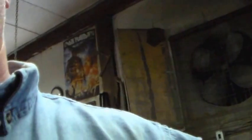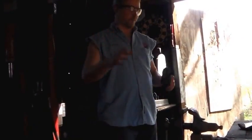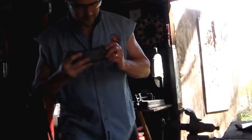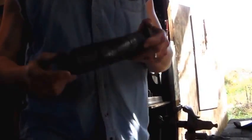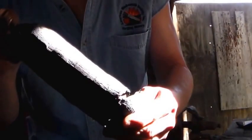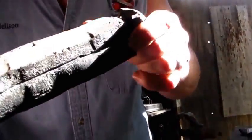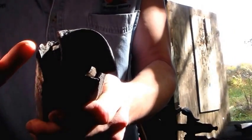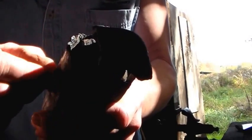Here we are again. Something I forgot to show you — this is the same welded can I showed you a second ago. Listen — you can hear it rattling in there; it's already a little loose. So what I'm going to do now is take my grinder on the vise and open one side of it up. You don't have to grind the whole thing off — all you've got to do is cut a slice in it with the grinder, then we're going to peel it off.